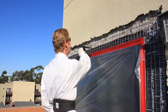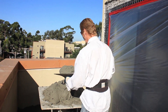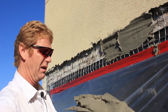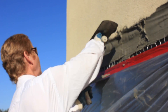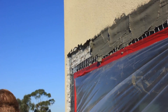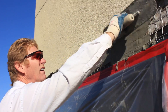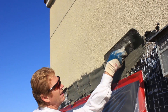I'll show you something. A tie-in right here, we're about an inch and a half. Now with a square trowel it's tough to keep it in that joint up there. I'll show you guys something with a swimming pool trowel — it flexes, you get your top, flex it in there. Just to prove a point I'll do this whole section right here. Okay, in the hot sun — notice this curve, you get it right in there.